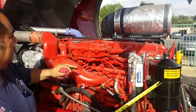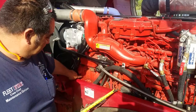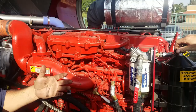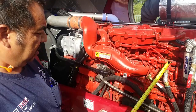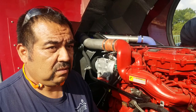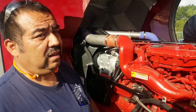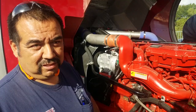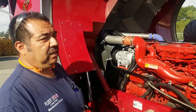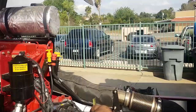From there look for oil leaks — these will always have some sort of weepage. You can already see a little bit in this area, some cracks and such, that is pretty normal. The class one around this engine is going to occur, but when you start getting twos and threes, something needs to be addressed. Do a visual — where is it coming from? Is it getting anywhere concerning? For instance, on the other side, if we're actually getting oil on the turbo, that's a very high concern because the oil could ignite. The turbo gets very hot — at night you'd watch that thing glow. During regen alone it can hit 1000 degrees with no load; with a load you'll exceed that.